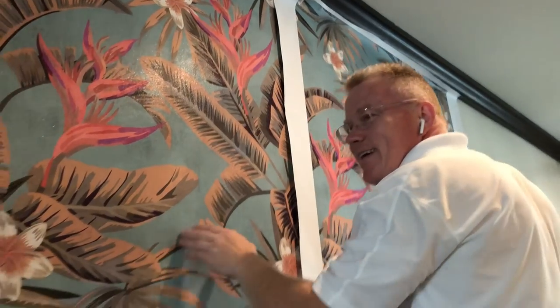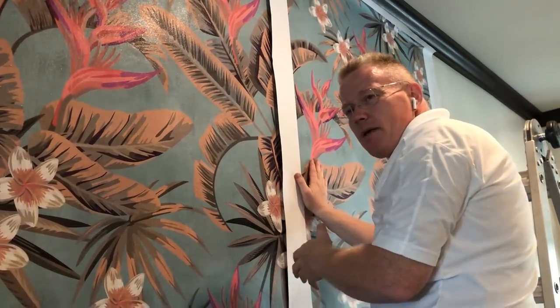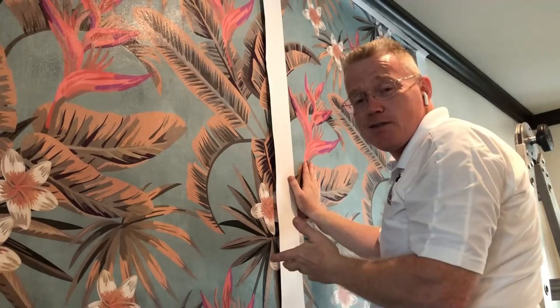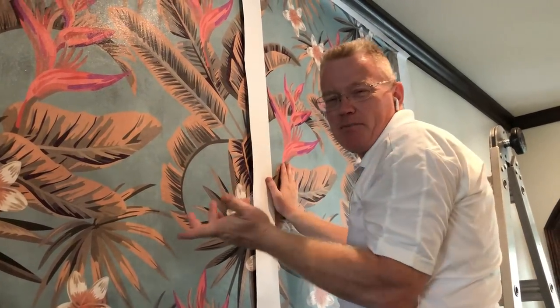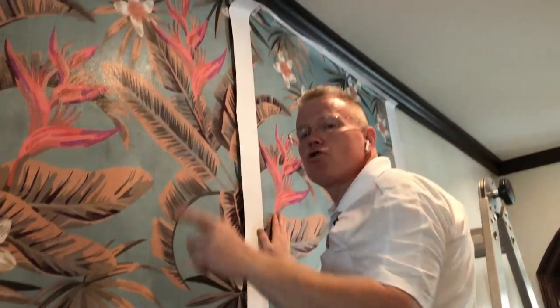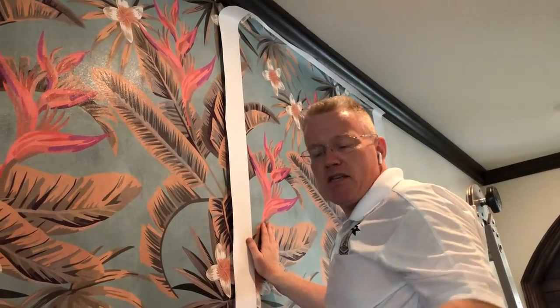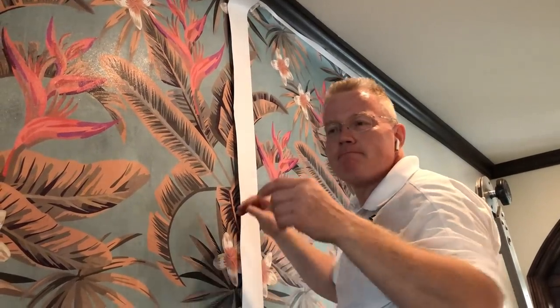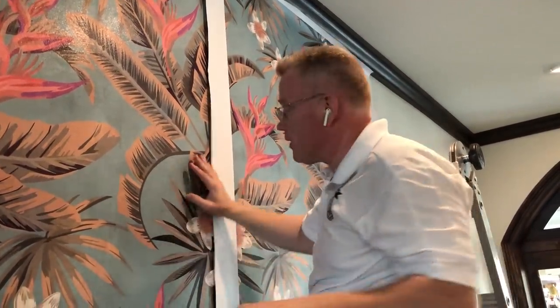But when walls are crooked and the wallpaper isn't stretching, it goes where it wants to go. You could wind up an inch off, even if you matched up perfectly at the top. You understand. Just take two perfect sheets of paper towels, right, six feet long as your body. Hold them exactly at the top. Look at how far off they are at the bottom. Now you got the point.